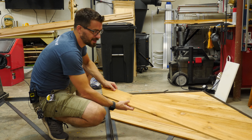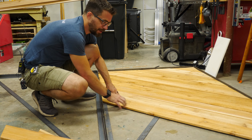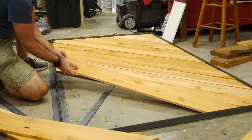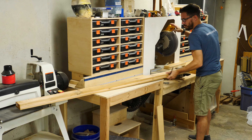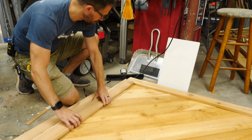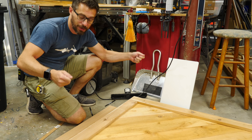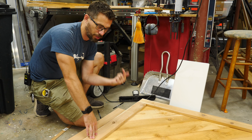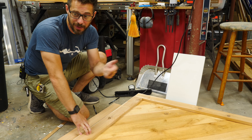I got a lot of these pieces cut down, and now we're just setting them in place. I'm trying to make sure that they're really tight. They are going to expand and contract a little bit once they're out in the elements, but there are some gaps here and there so they should be all right. I've got this back frame cut down to fit in here, and it does two things: we're going to drive in some screws from the back side to lock all of these pieces together into a big panel, and it's also giving thickness to the outer edge so that we can attach it to the steel frame by driving screws from the front side through the metal into the wood.